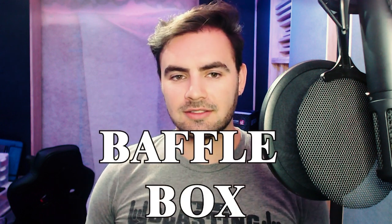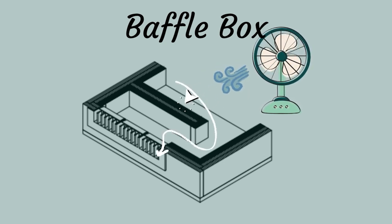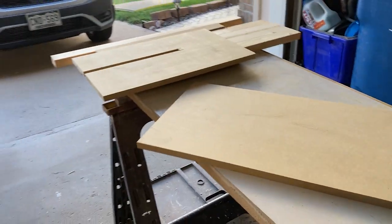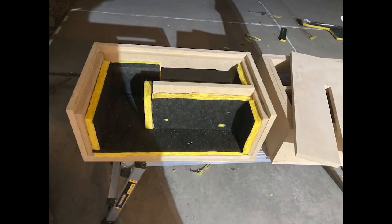The last step is controlling the airflow we do want. Now that everything else is sealed tight, we only have air coming in through the floor vent and out the vent above the door. What we do is build what's called a baffle box, to essentially treat the air as it moves into the studio — removing the sound but keeping the airflow. A baffle box is a little maze that air has to travel through, where all sound hits absorption points and is stopped, but the air keeps going. I built this with MDF — Medium Density Fiberboard — cut to specs sent by John Brandt. The maze was created, lined with rigid duct liner — plenum specifically, so it is designed to be breathable — and closed it up. Vents were installed on the openings and they were ready to go.